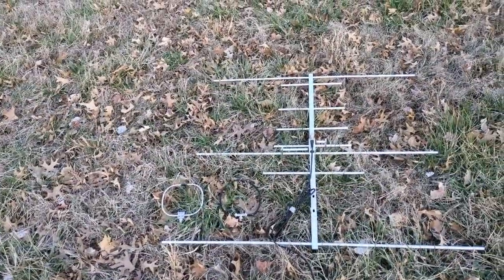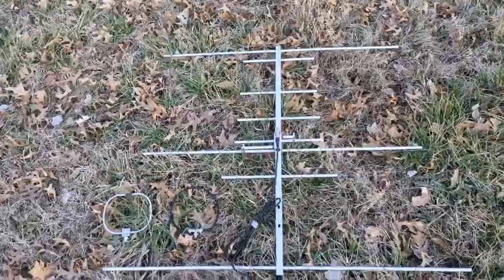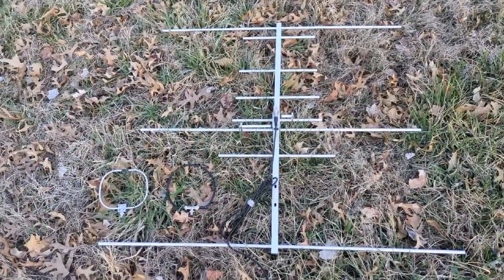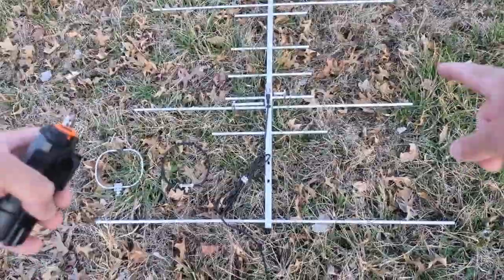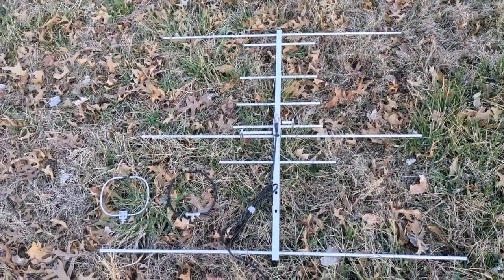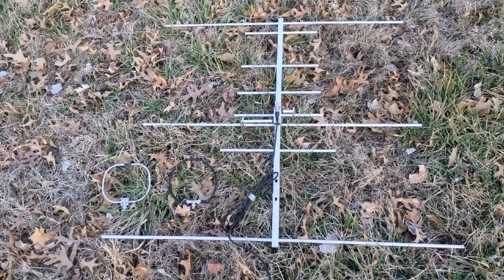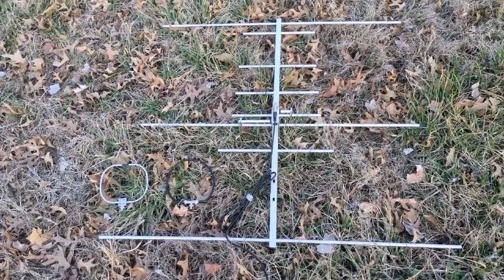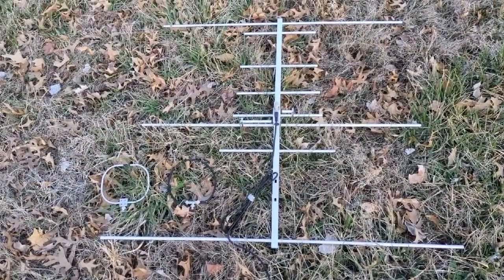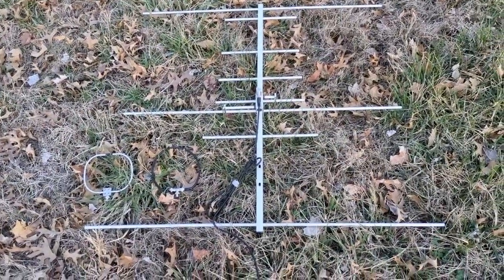The tools I have today, in addition to the Quan Shang, is this big Christmas tree antenna right here. It's called a Yagi antenna, and this is a stacked Yagi. The three large elements are for about 140 megahertz, and the small elements in the middle are roughly 440 megahertz. So this is a dual band VHF and UHF Yagi.